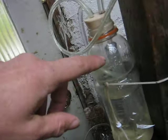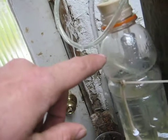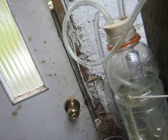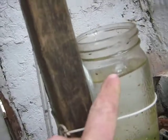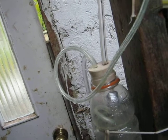The level of the water in here is coming down fairly quickly and going into the little — we call this the pumping chamber. Once the water level gets over the top of the siphon again — the siphon is up to here — it will start pumping again. So it's only pumping from here to here, about two feet, but could be more.